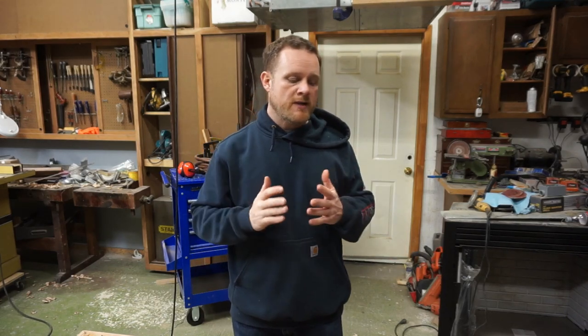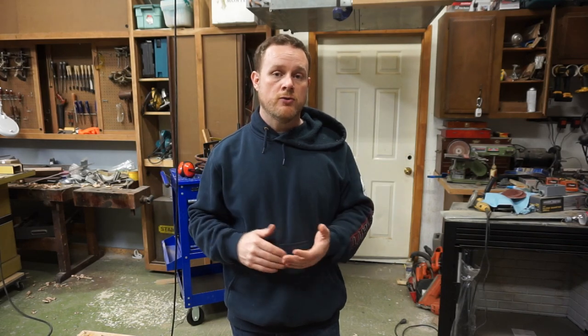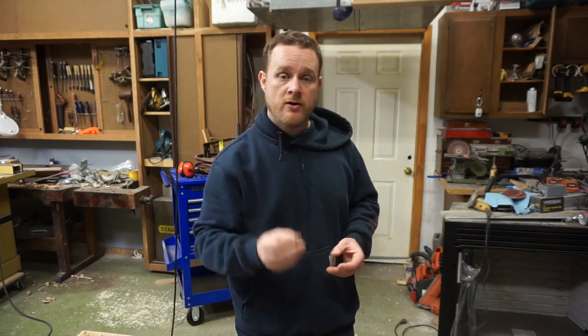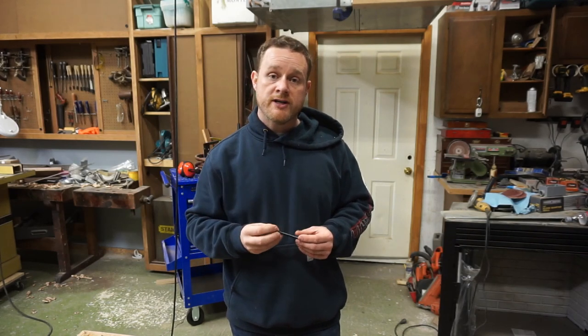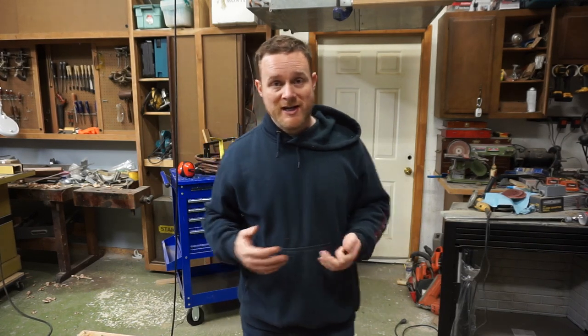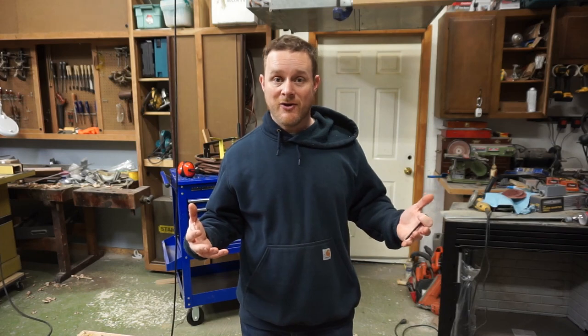Also, because my spans are a little bit more than 16 inches on center — or maybe just offset from where the bolt holes are going to be with the hardware — it gives me a good solid board to mount to. So my lag screws mounting the hardware will go through a 5-quarter inch pine board and then into the 7/16-inch OSB that's on the wall.